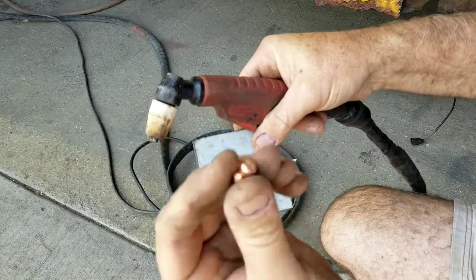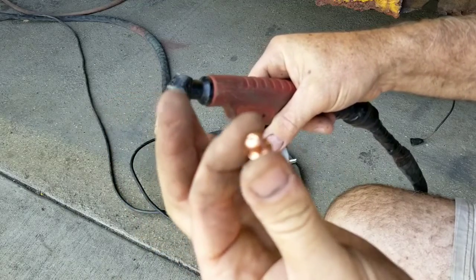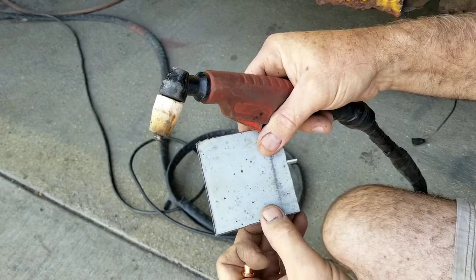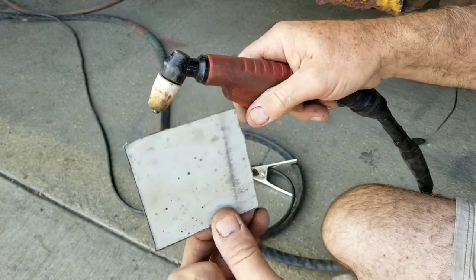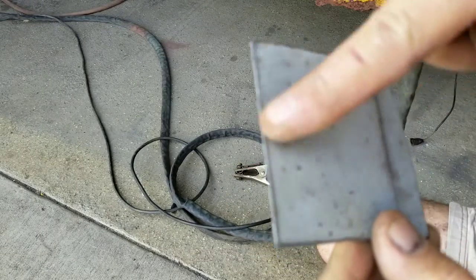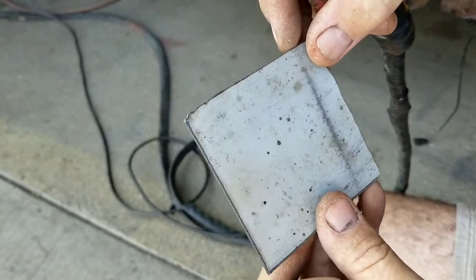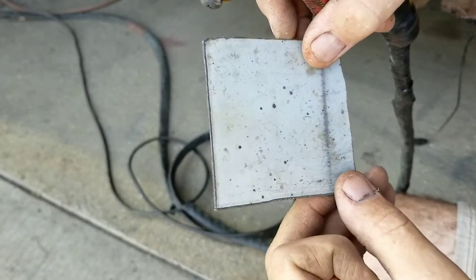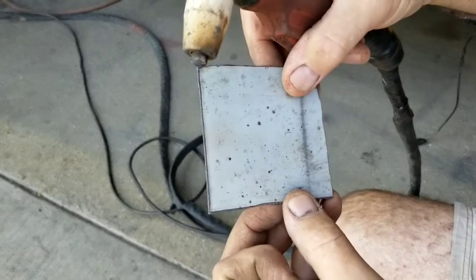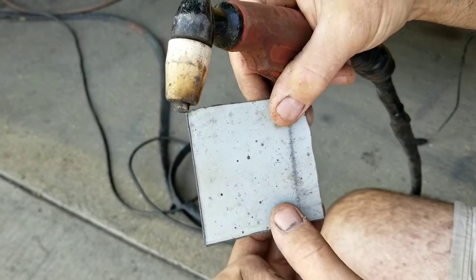What I do — these are called consumables, and that's exactly what they're designed for. You are designed to go through these things. I go through a lot of consumables because I don't want slaggy cuts, I want clean cuts. This piece right here was cut with a plasma cutter — see that edge? That is clean, straight, and nice. That's what you're looking for. This is 18 gauge — that's something I would be cutting with the plasma cutter.